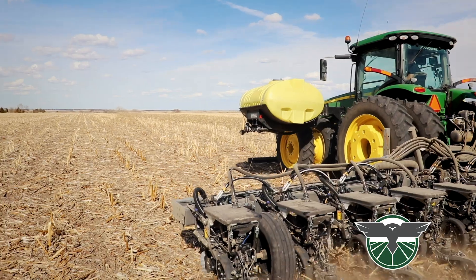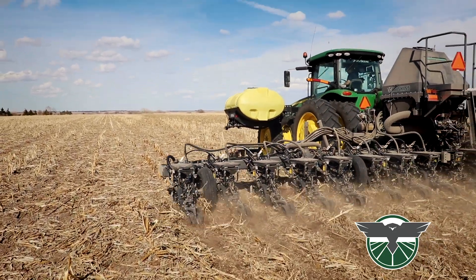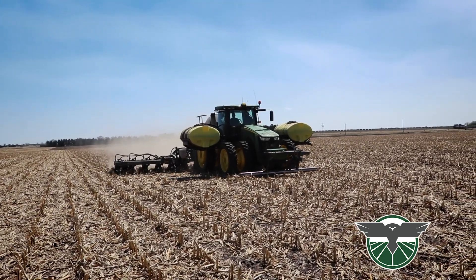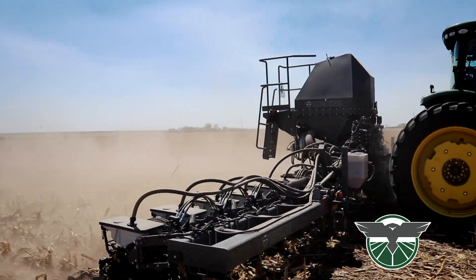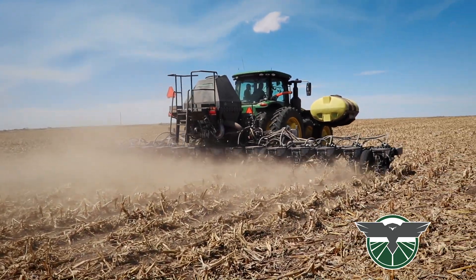That brings on more challenges for the planter. One of them is going through the field, which can cause the wings to ride up because there's just not enough natural weight in the wing. We've done a couple things to help fix that. One is we've made our wing out of heavy-duty seven square, that's a half-inch thick, so it's just more natural weight. The other item we did was add hydraulic wing downforce, so we can transfer some of the weight off of the center out to the wings. It just keeps the wing from riding up and you don't have to hang big heavy suitcase weights on the wing.